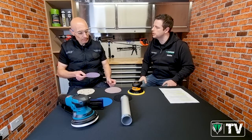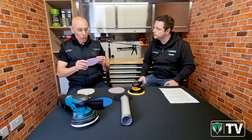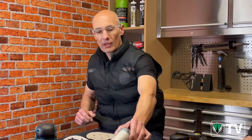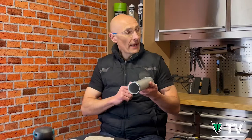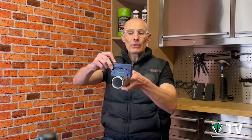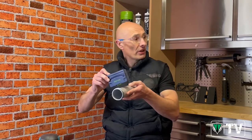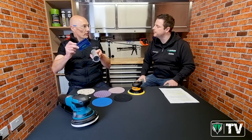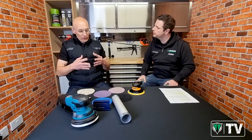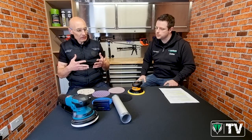What are the disadvantages of a mesh product? They're more prone to tearing and grit loss when sanding edges. Because the grit is bonded to a filament or strand of the net material rather than a solid surface, it doesn't have as much surface area to bond to. When sanding edges, grit can be stripped and pinged off - that's what causes premature grit loss. They don't fall off very easily, but they're more prone to it than coated abrasive discs. The other issue is that net abrasives can be quite hard on backing pads, causing them to wear out prematurely.